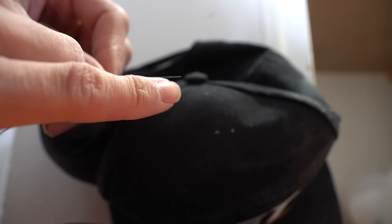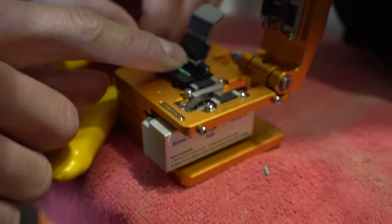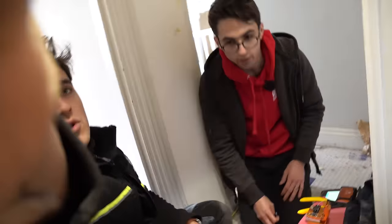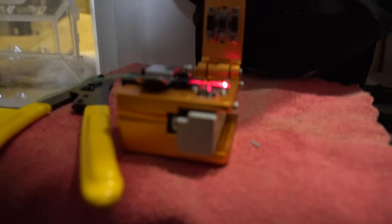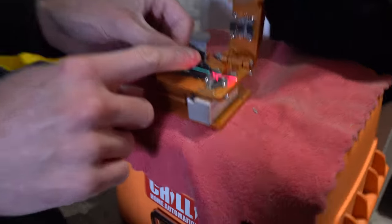This cut edge is not good — if we look at that edge under a microscope it'll be all jagged. So we're going to cleave it. You can see lots of light spilling out of the glass, and if you look at the projection down the edge it's quite messed up — that's because it hasn't been cut straight. This is why you need to cleave it.